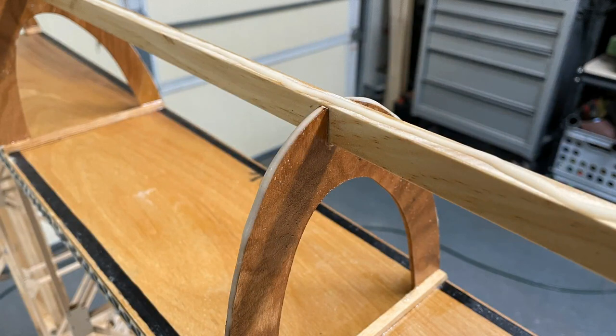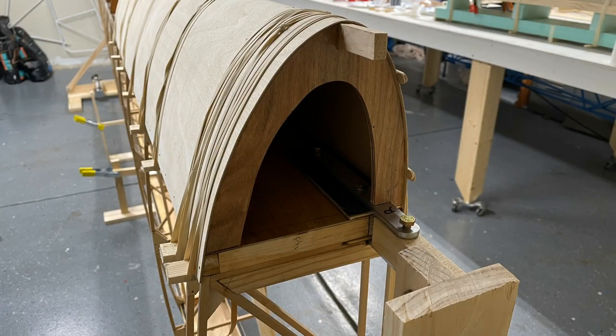On the next skin I'm going to do things a little differently. You can see there's a really nice fit, but I've got some popsicle sticks placed in spots. I cut the ribs five at a time and thought they were perfect, but there's about a 64th of an inch difference in some ribs where light showed through. I placed popsicle sticks there — epoxy won't expand. I originally planned to use gorilla glue in that area because it expands, and I'm going back to that plan.